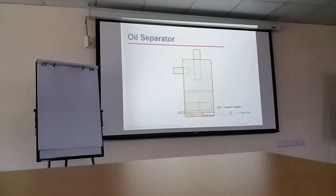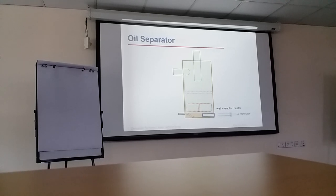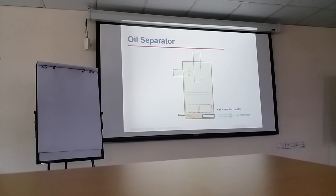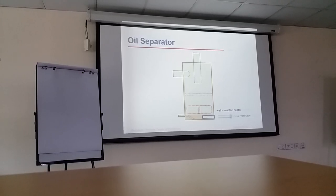This is just to ensure that when your compressor is in idle condition, the refrigerant separates from the oil, so there is no liquid slugging on startup and lubrication is maintained for the initial start.